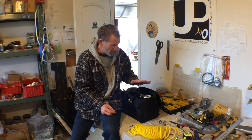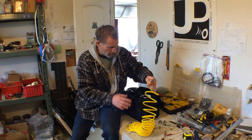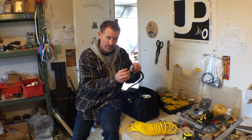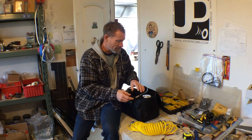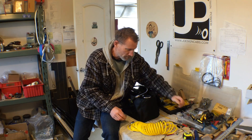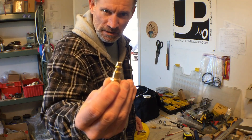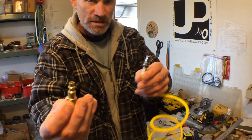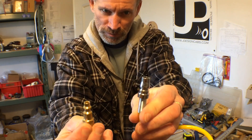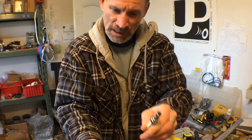On this modification, I did two things to this air compressor. Number one, the air hoses and the connections on the air compressor are the Japanese style — just a little bit different than your standard SAE style connection. I've got a couple of different ones here. This is the standard connection, and then this is the Japanese style. This style won't work with your standard air hoses.